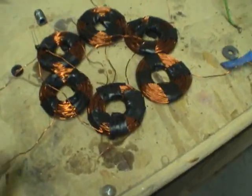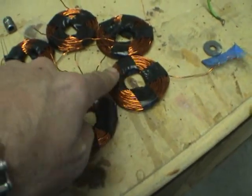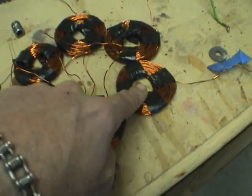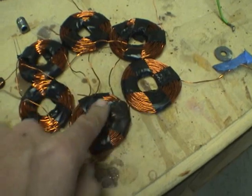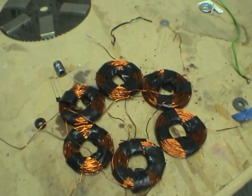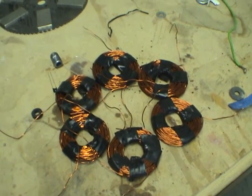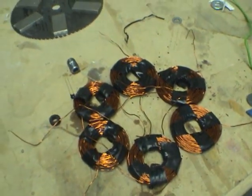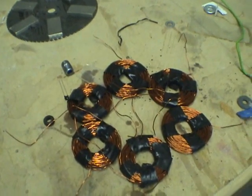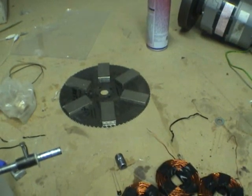You can see I made the new coils. I've read that more area of the coil that the magnet passes through is better, and my other coils didn't have that area. It's still 100 turns on 22 gauge wire. I used 22 gauge instead of a higher gauge like 14 — that's more for low RPM applications for an alternator.